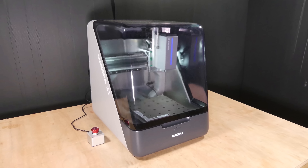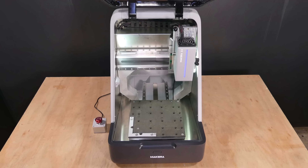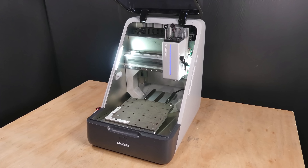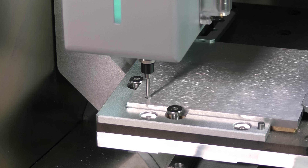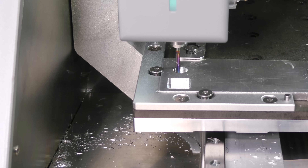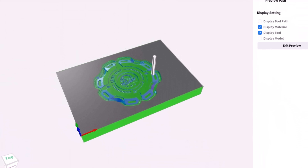This was my first look at the Makeera Z1. It's an excellent small desktop machine with very similar features to the Carvera Air, but with a smaller working area which would suit model making, robotics, mechanical components and PCBs. I'm happy with its ability to mill aluminium and the accuracy I've been able to obtain. The spindle motor never seemed to lack power. The AeroDust system is very good at clearing chips, and overall I prefer the new dust collection system to the dust shoes used on the Carvera and Carvera Air. Makeera will shortly release a new software platform, so I hope to cover that and the Rotary Fourth Axis in the next video.